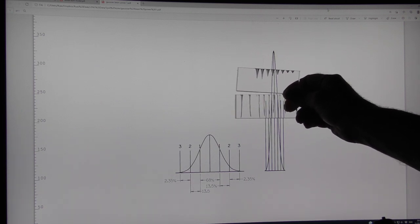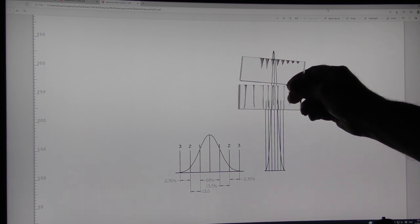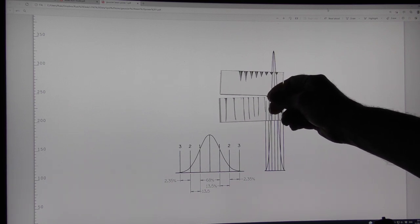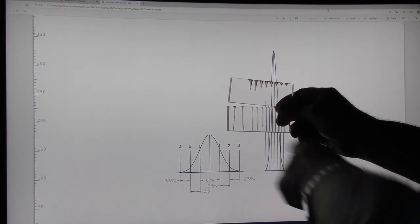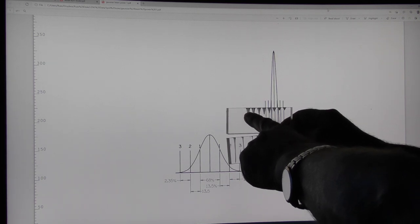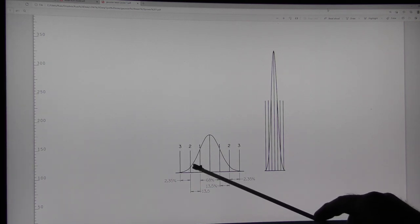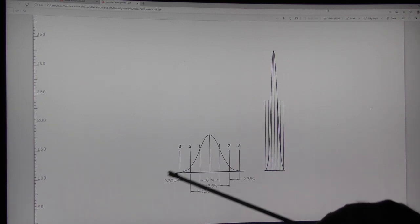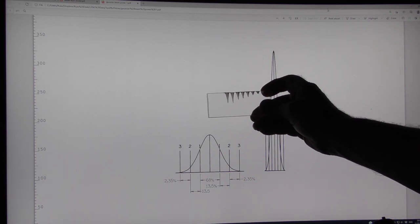How did it do damage? It was shaking molecules, remember? Keep thinking of this right down to the basic level. We are shaking molecules to destruction and making them disappear. Right down at the bottom of this hole, right down here, we're shaking more molecules here than we are here, because at the top of the hole we've got less intensity, and because there's less intensity the rate of doing damage is less, and that's why we get this conical burn.